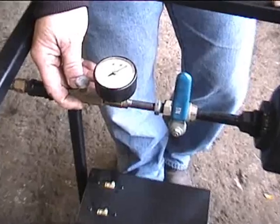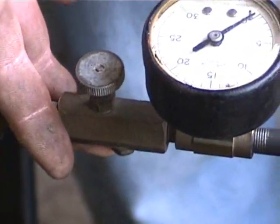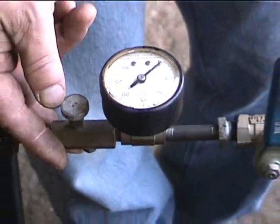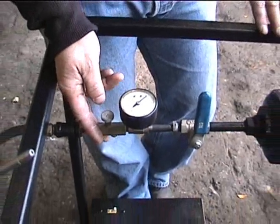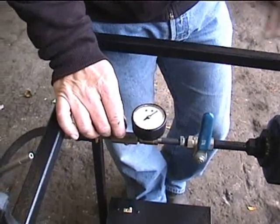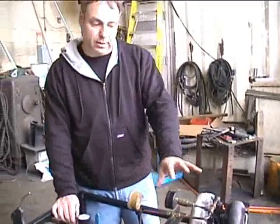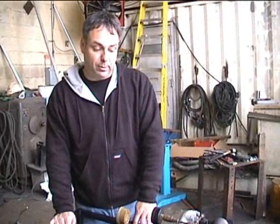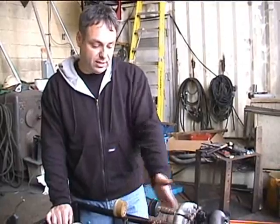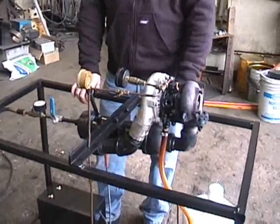This is the needle valve, and I would suggest to anyone wanting to build one of these that it's a very important item — but also a very simple one. It's normally found at any automotive supplier; it's used to control the flow of air to air tools. It's very important for regulating the mixture of propane to air so that we can get it to ignite. I would say that most people's problems when building this type of turbojet are probably based on the wrong fuel-air mixture. As you can see, almost anything will work — it can't get any more basic than that, just a simple piece of three-inch pipe.